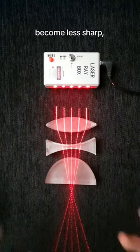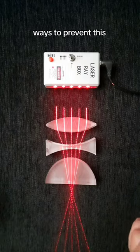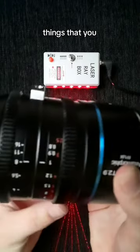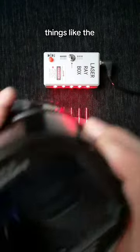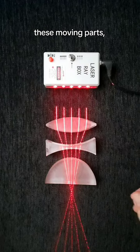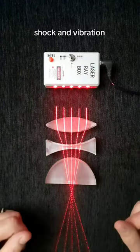So that can make the image become less sharp and decrease your resolution. But there are a few ways to prevent this. These lens assemblies often have moving parts — things you can adjust to change things like the aperture of the lens. By simplifying the mechanics, reducing these moving parts, and gluing the individual lens elements in place, you can reduce the effects of shock and vibration.